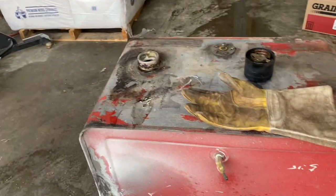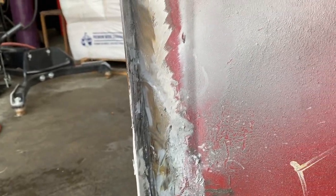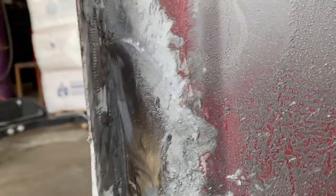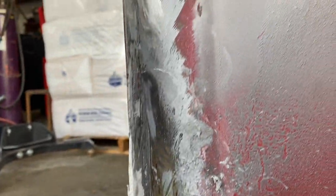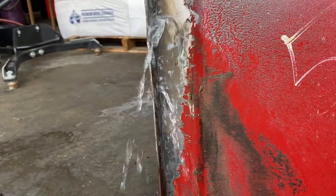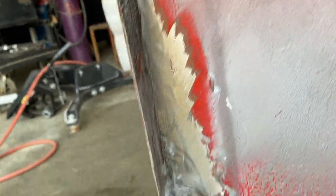I got the tank off the unit and I've been cleaning it up - cleaned off the old epoxy garbage that was on it. Now there is water squirting out. I filled the tank with water rather than diesel to help flush it and I've got it pouring into the drains. It looks like it was a crack originally - I'm going to clean up all the other epoxy, then MIG weld it on a very low setting.